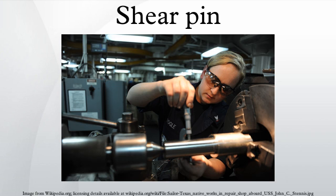In the role as a conditional operator, a shear pin will be used to prevent a mechanical device from operating before the criteria for operation are met. A shear pin gives a distinct threshold for the force required for operation. It is very cheap and easy to produce, delivering very high reliability and predictable tolerance. They are almost maintenance-free and can remain ready for operation for years with little to no decrease in reliability.